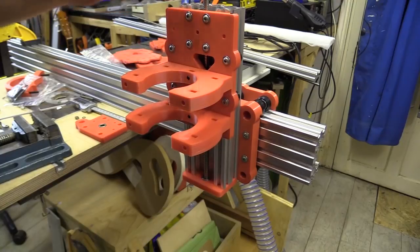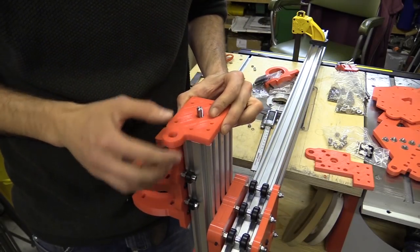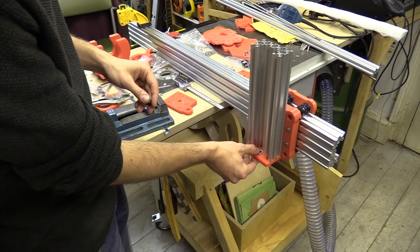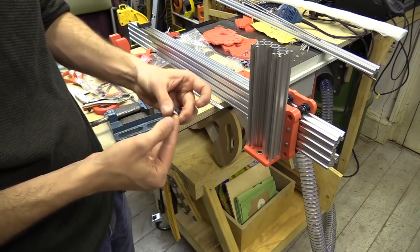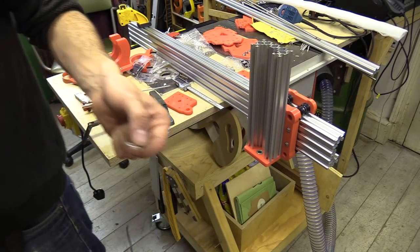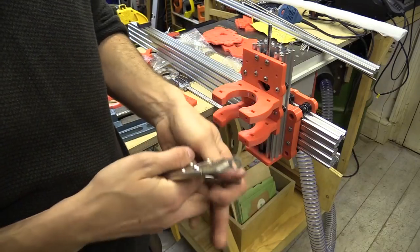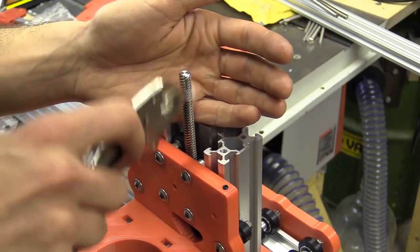Though when I do line that up, the top plate is a little bit far forward - I could push it back. I think it's going to work. I think it's fine. This is the washer or shim that goes on top of the 688Z bearing, and then the locking collar goes on top. This isn't from any CNC suppliers - this is actually a seal washer which I think is for plumbing. I'm just going to put the aluminium washer on the end of a small grip and then just by hand take an 8mm bit - and that's made all the difference.